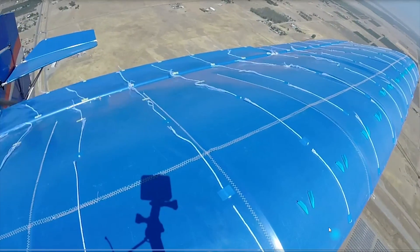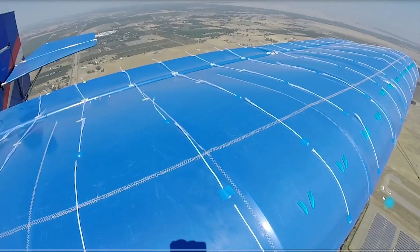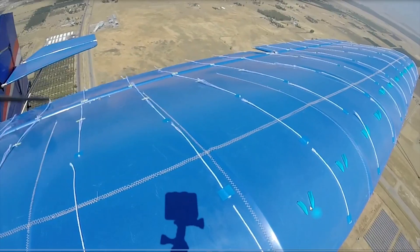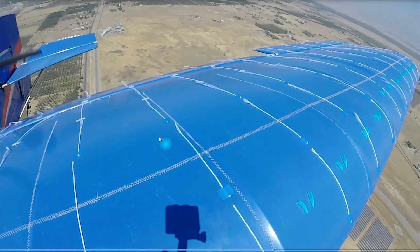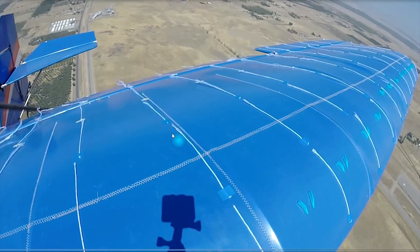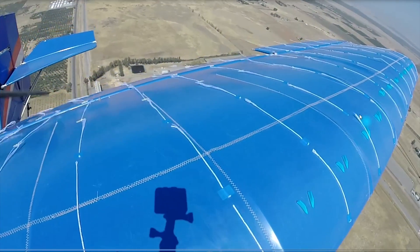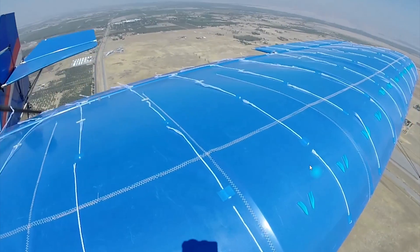That's our next generation result. Of course during the test flight, there's no way to see what's going on up there — I can't look at this until after we land and review the video. We've made some changes, and on each segment we do a complete test with flaps at all three positions — 10, 20, and 30 degrees — as well as bank angles. We've made some improvements but still have some areas of disruption. Now we'll look at the changes on the next revision of placement for these particular vortex generators.